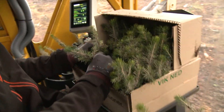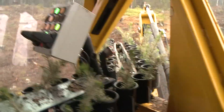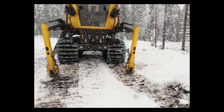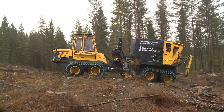In the cab of the base machine, from where the scarifier is controlled, as well as in the cab of the planting unit, control buttons can change these settings. The planting arms are adjustable sideways, so the distance between the left and the right planting tip can vary from 1760 to 2740 millimetres.